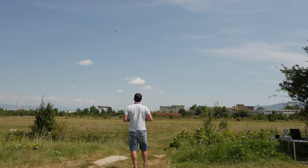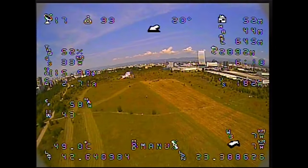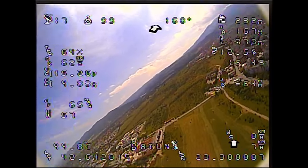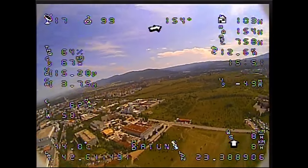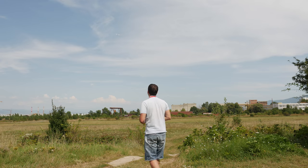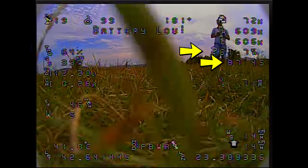The day I picked to do this wasn't the calmest, so there was quite a bit of shaking around, but it did fly and after trimming it a bit I did test the fly-by-wire A mode and it worked great in stabilizing the plane. It does need some up-correction on the accelerometer calibration as it is pulling it down just a bit, but that is easy to do. Return to home on a switch worked pretty well, as did auto-tune, and I did feel like it sharpened the responses of the plane a bit, although I didn't spend too much time on it because this kind of weather does not create the proper conditions for a good tune. After that I recharged the battery, set up a simple mission, and tested auto-take-off which worked perfectly, and did let it run that mission for as long as the battery would allow. It made it to about 90 minutes and covered just over 60km before landing, which was about on par with my endurance run a while back — but I have to admit that the autopilot was not as sparing with the throttle as I was, so I might have to give it a try myself again and see if I can do better.